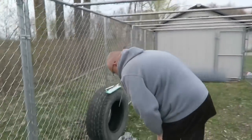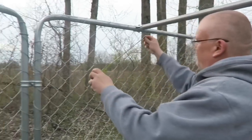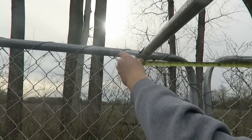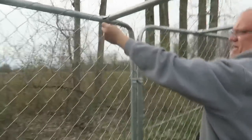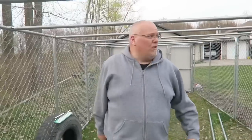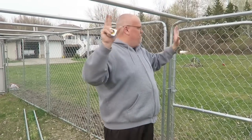Then I take my measuring tape, start on the end rail, mark three feet off from the nut, and measure across. I put the bracket on initially — lightly on both sides — then saw off the end, put the pole up, and tighten it. I measure again at the very end to make sure once it's up and set where it's loose and hanging that I've got it right, then I adjust it and tighten it up.